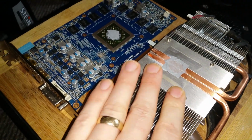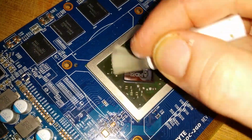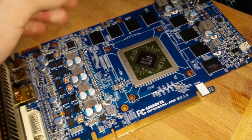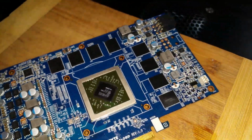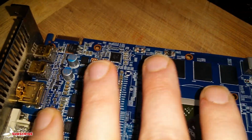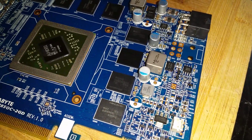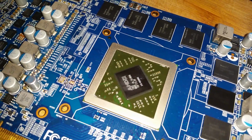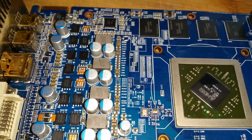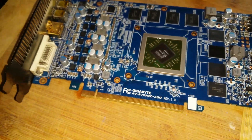First of all, we need to clean the card, reflow the chip, and hopefully it will be working again. Once you clean all of the dust, the card looks pretty nice, shiny, nearly new condition. Once the card is clean like this, check that there are no missing components anywhere by simply visual checking. Yeah, I checked the card and I don't see any broken or missing components on it, which I have a feeling the reflow will definitely help, and we'll try that.